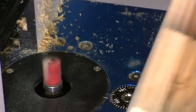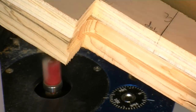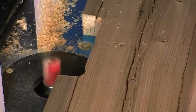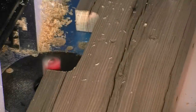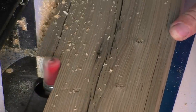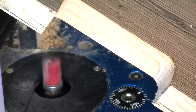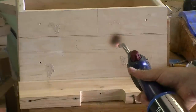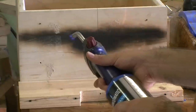Using a three-quarter inch pattern bit, I copy the handle template to the drawer front. Back at the bench, I hold the finished front to the drawer and trace the hole outline, then use the torch to char the surface. This is done for the four double drawers, as I only want to add the illusion of two separate drawers.